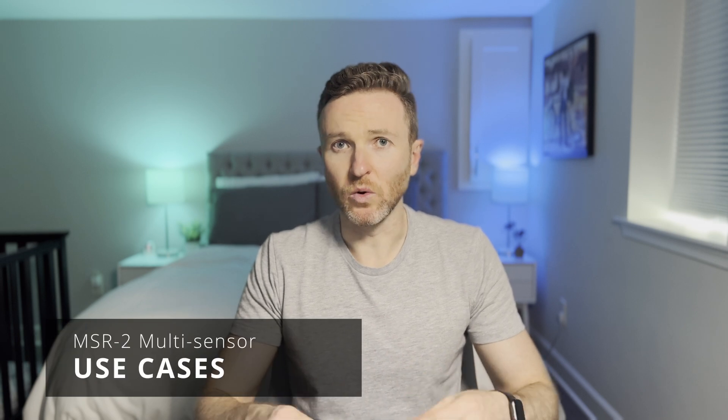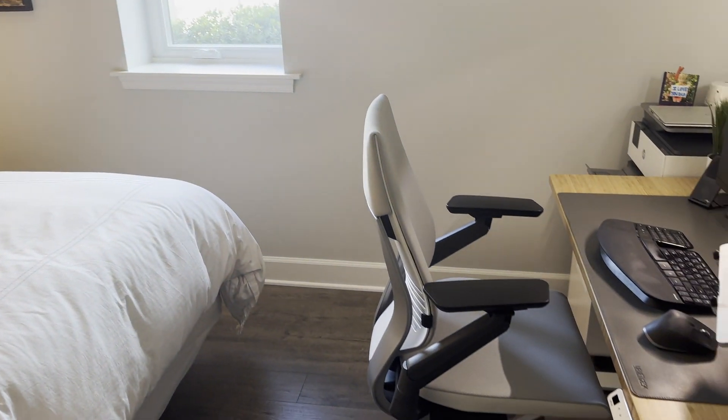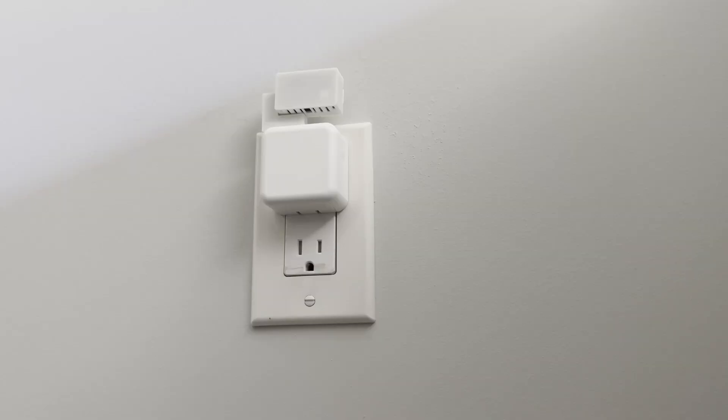Let's talk about how I'm using this or how you might want to use it. Millimeter wave is the killer feature of any smart home because presence detection unlocks so many possibilities. I'm using it to automatically turn off the lights in my office when no one is in the room. Turning on the lights can use a condition to only do so when the LUX sensor detects a low level of brightness. You could also turn on a ceiling fan when the temperature sensor or CO2 readings cross certain thresholds, or turn on an exhaust fan based on humidity in a bathroom. I have the built-in RGB pixel turn green as a reminder on trash nights.